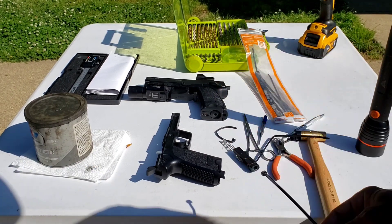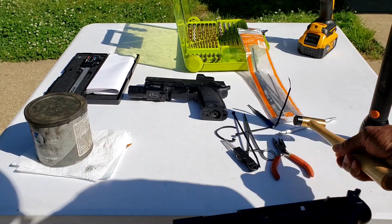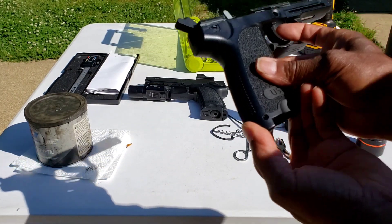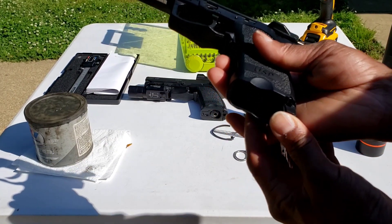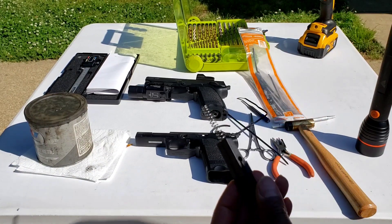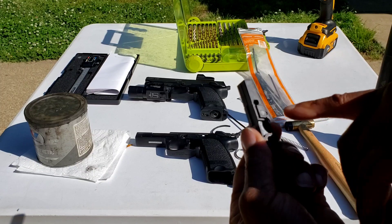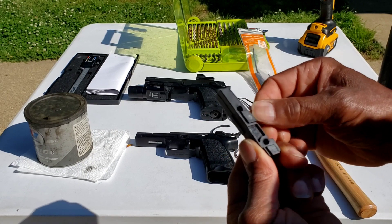It can be longer because you're going to cut it anyway. What you're going to do is take a punch and a little hammer and hammer out this pin — it doesn't matter which side you hammer from. Once you hammer it out, keep your finger here because it's under spring pressure. Pull the pin out, the spring will come out with it. Then you're going to drill a hole — hopefully you can see that — above this little extrusion where it's sticking out right there.